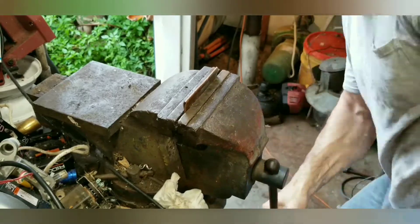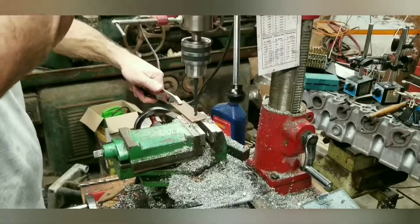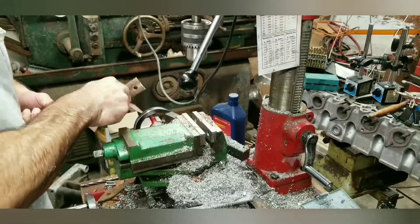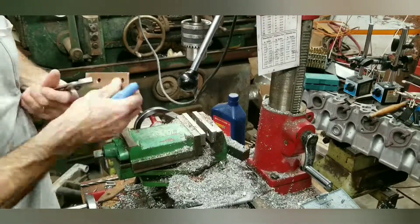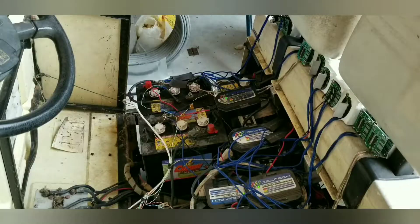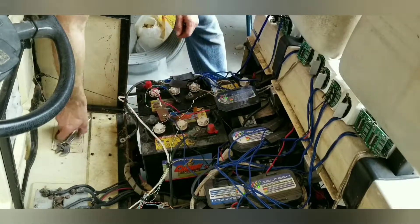So what we're going to do is — this is almost like a proof of concept thing. It's going to prove that this is going to work because I've got some future improvements coming. Take a piece of copper pipe and make a little bus bar out of it, so that I can bolt a whole lot more things to another battery terminal. Because once you start bolting a whole bunch of wires to them, it gets really tall and the stud's just not long enough to put the nut on there anymore. We need to extend that out, so take a little piece of copper pipe and scrap copper, cut it to length, flatten it out in the vise, drill some holes in it in the mill, and then you saw me there using the deburring tool. That has made all the difference in the world — it really improves the quality of anything you do, and that tool is really easy to use.